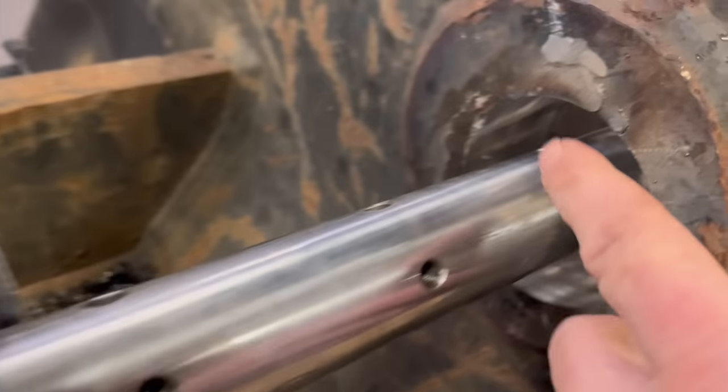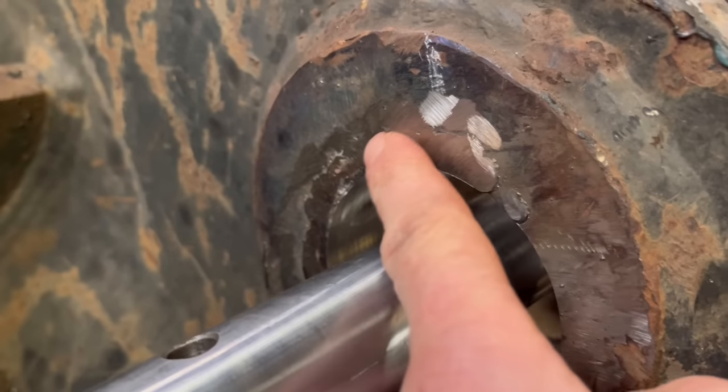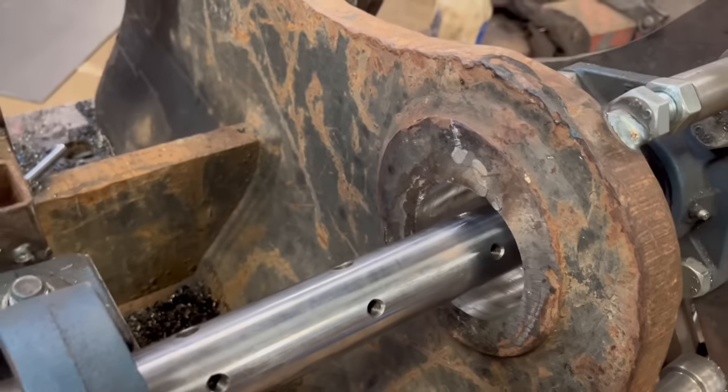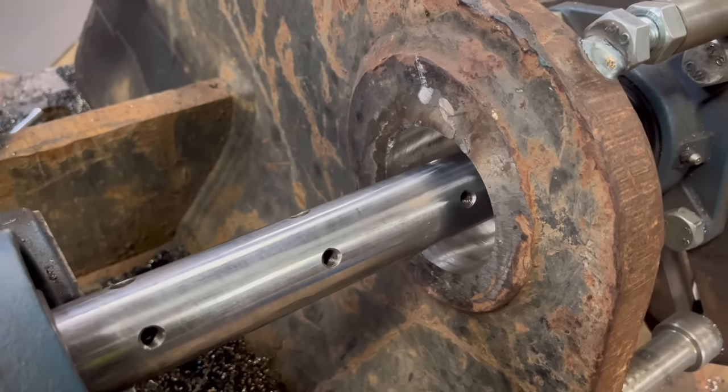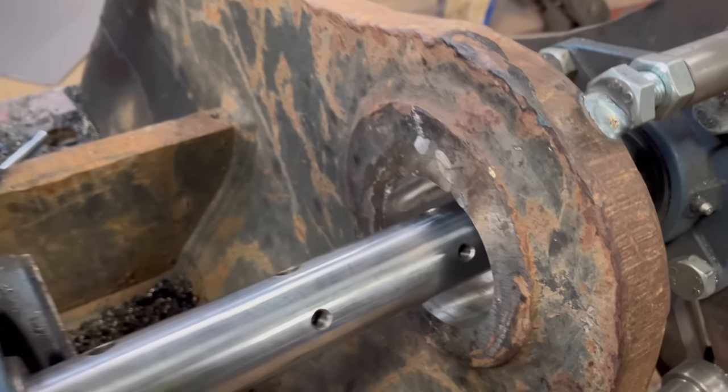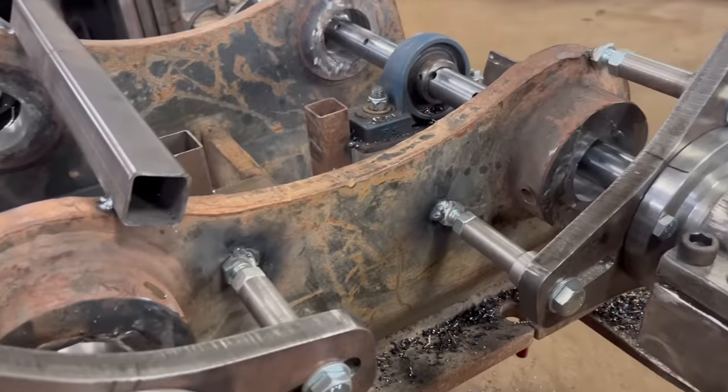There's just a bit more. I'll have to grind a bit more off. I only sort of roughly ground it off, so that one's smoothing off better. I don't have a facing head either, so I can't face them off. But it shouldn't matter. I'll just buff them off at the grinder. So that's that part of the job done.